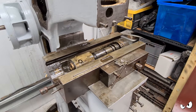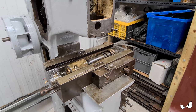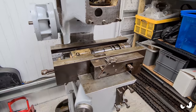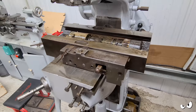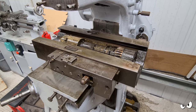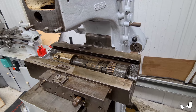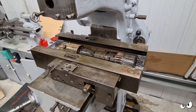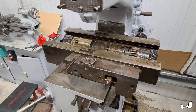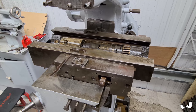Everything has been drenched in oil, and I mean drenched. I've been painting it on. Every inch of that is covered, top and bottom, inside and out. It needs it, basically. All the bed was oiled up and everything else before it went on. Gibs on both sides got done too. It is literally dripping. I'll obviously wipe the excess off it, but for assembly purposes, I want everything swimming in the stuff, basically.